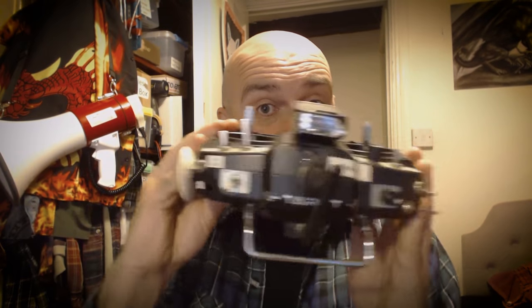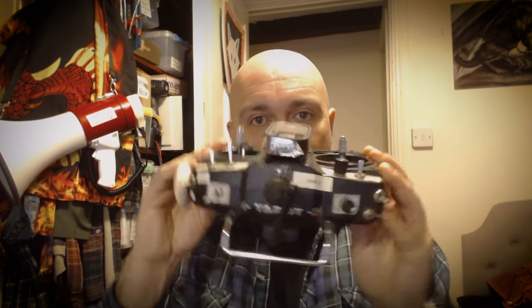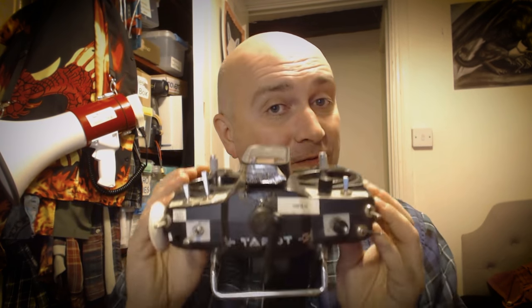And this is what they call twitching. Okay, that's with the gain set too high. So too low, it's going to drift off. Okay, too high, it's going to twitch. Okay, so what you have to find is the perfect balance where if you push it, it comes back and stops. Push and come back and stop.